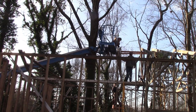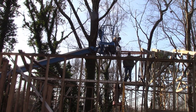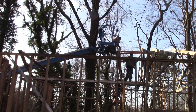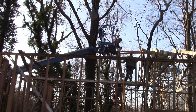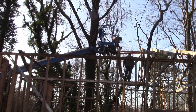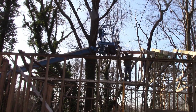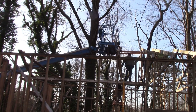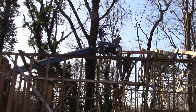Basically what we're doing right here is standing up these trusses. There's actually a very limited amount of videos on YouTube about standing trusses and setting them using the process we're using here. My dad is up there on a walk board — we have a board nailed on the wall on the opposite end and scaffolding set up in the middle, and he's using that to nail off the bottom. One of my friends, Connor, is out here helping us on a scissor lift.